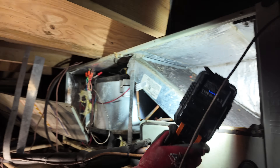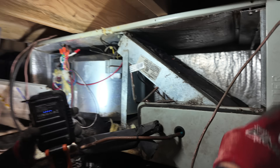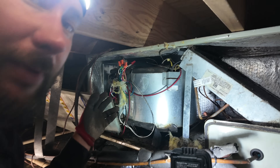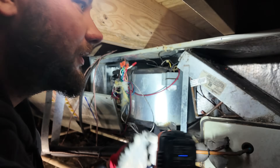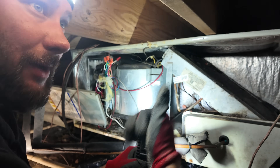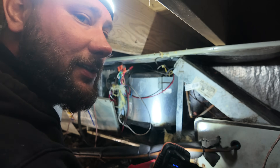I cut the cover off and you can see this is the indoor coil. Take a look — completely packed solid. That's the reason we don't have any air flowing. Do you see a filter? No, there's no filter. Here's where the filter is supposed to go — you can see the little cover that says 'filter,' that's where they take the cover off and install it. I did turn the breaker off and the thermostat off so we're as safe as possible. There are only three screws in this panel. I brought 5/16 screws with me because we're going to put all the screws back in. Whoever was replacing this filter just decided to make it as easy as possible. Once we get it clean, we're going to build a rack and put the filter up there so they don't have to deal with this anymore.